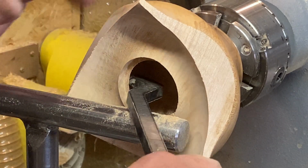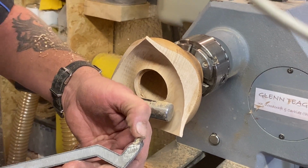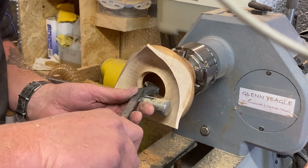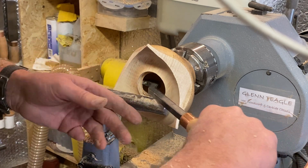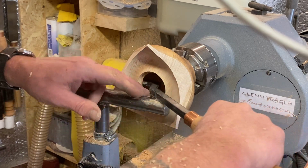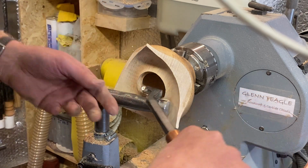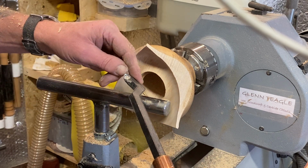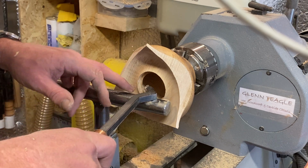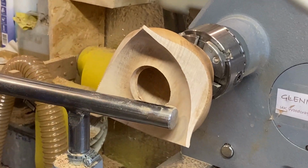When you come round to here, I'll get a little bit of grabbing because I'm not then working off the tip. I'm off the tip for the side, but I'm also coming out on this front bit, which is what I'm trying not to do. I want to really be round here. I should have maybe brought the tool rest back a little bit, and then I could have gone further, but I was in danger of falling off the end of the tool rest. If I'm going to undercut, I want to be round here so I can undercut with this part of the cutter, not this part. If you're just using that part, it's just scraping, and then you're scraping and cutting at the same time, but you could see it wasn't a bad grab or nothing. There's no bad grabbing.